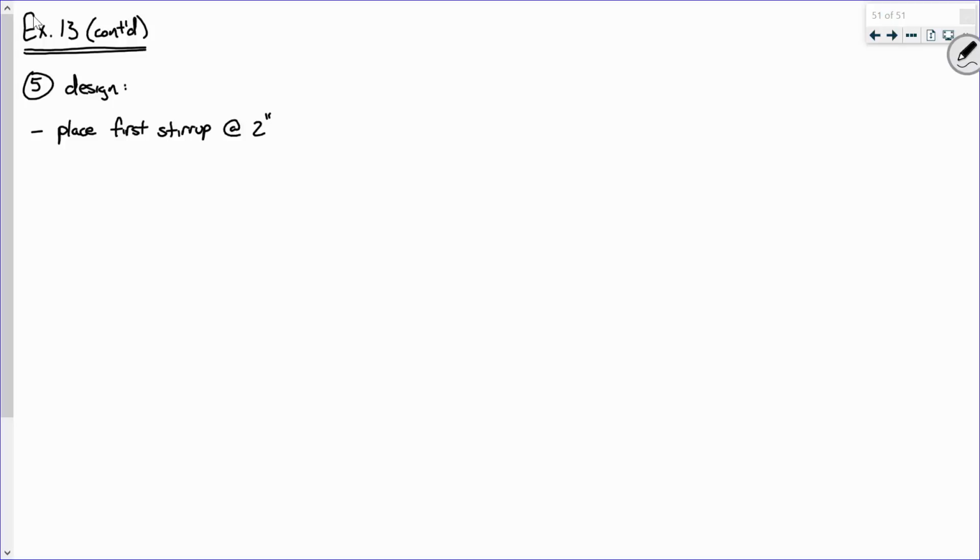So what I'm then going to do is use 4-inch stirrup spacing, and I'm going to use that until I hit what value? 60. How far along the beam do I stop using 4-inch spacing? 58.88 inches, right? Well, okay, I see where you're talking, and you'll see how I handle that in a second. Until x equals 58.88 inches. And I see where you're getting at. It's not quite 60, though.